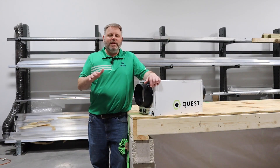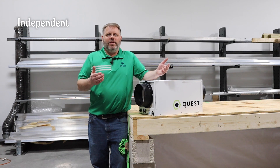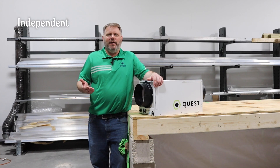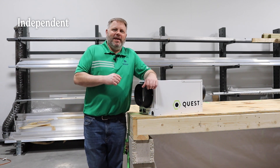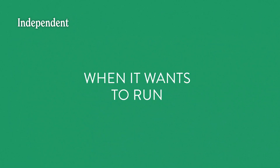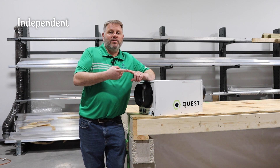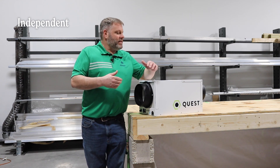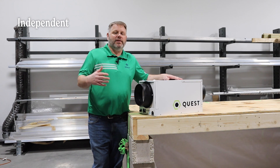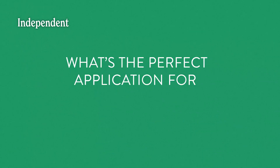The last configuration is completely independent of the HVAC system — nothing to do with that system at all. We could hang it from the ceiling by threaded rods, install it above a plenum with ductwork bringing air to and from the unit, or install it pretty much anywhere we want. Either way, we get a dehumidifier that runs when it needs to run, completely oblivious to whether the HVAC is running or not. It sees the highest dew point air, giving us the most capacity, and can run all night long even when the HVAC is turned off — pulling down moisture, drying out building materials, and preventing mold, mildew, and other effects of high humidity.